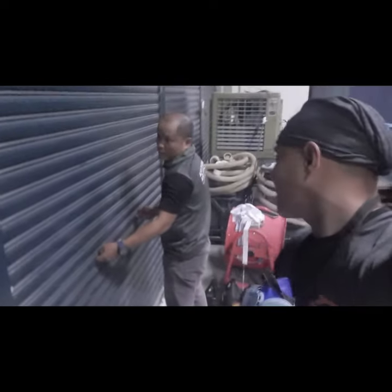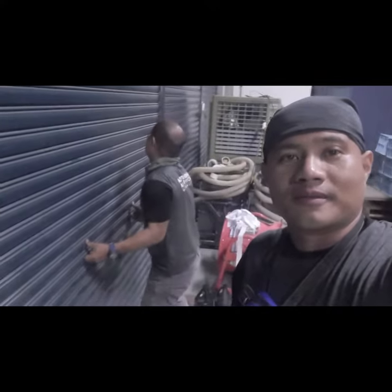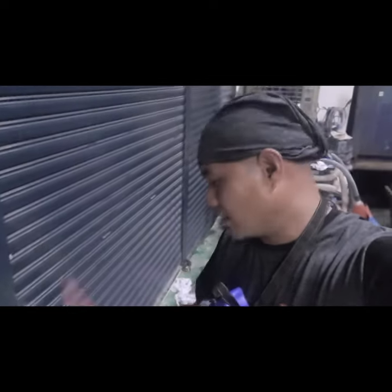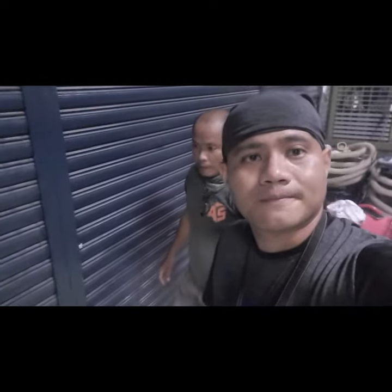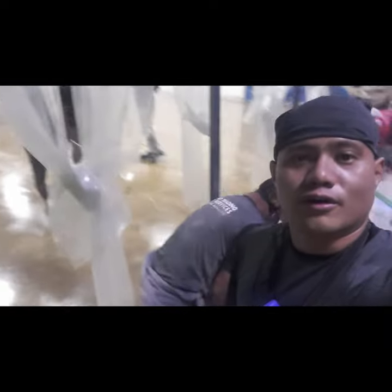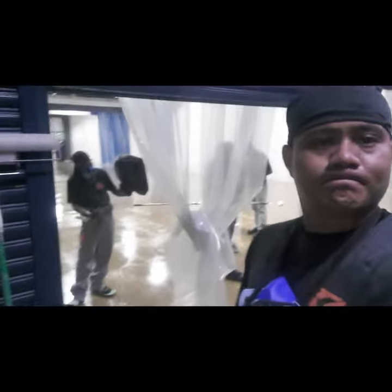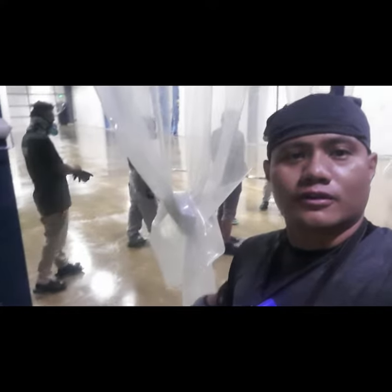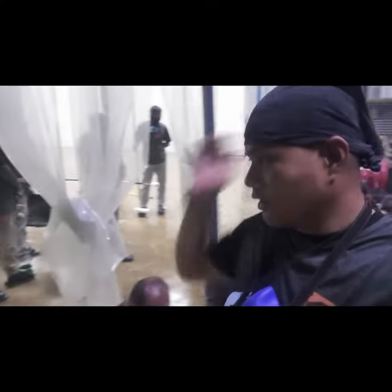Right, so more than 2 hours has passed. So me and our supervisor here, Brad Joel, will be inspecting if our primer is getting tacky, and that's the time we're gonna be putting our first coating. So we'll just be going in, but we need to have our respirator on. Okay, so our primer now is tacky. So the crew now is getting ready for the first coating of epoxy.